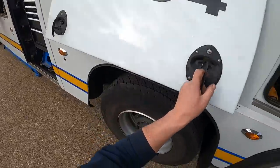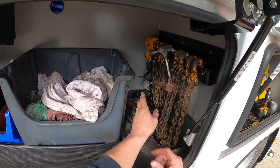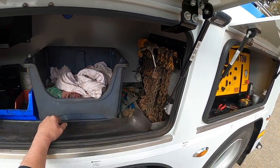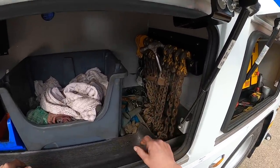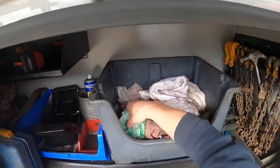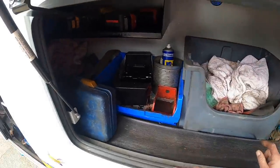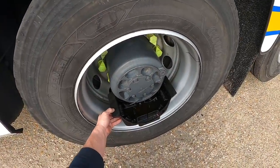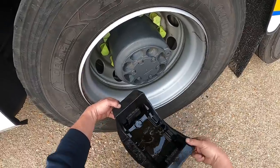The next locker to the right - I've got some chains. These are light chains, we don't use these for winching - they're retaining chains to keep the axle on the forks. We chain them around the pedestals, so they're retaining chains, not winching chains. A good old club hammer, some extra gloves, the dirty bin, some bags to cover the half shafts to stop any mess, plenty of old towels, and an oil pan designed specially to go under the half shafts when you pull a half shaft so you don't get oil on the road.